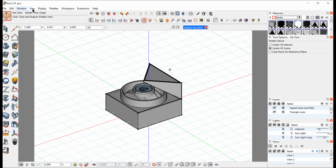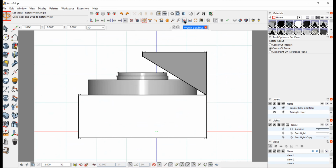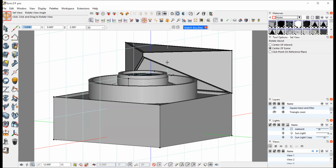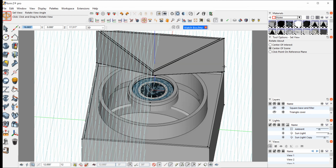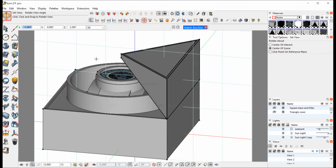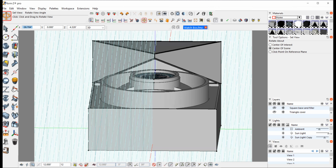And another feature of this part is that I want it to come over the top of the watch and not lay its weight. So any pressure on the top of this box would not be pressing on the watch. I want it to be pressing on the tube. And the height of that tube is significant because that's what's keeping those upright in that position. And also, these are going to be hinging off of that bottom box. So when all four of those hinge at the same time and they meet in the middle, that is also supporting all that weight. So I had this triangulation on all four sections, they're all leaning against themselves and they're pressing on that inner tube. So we have a lot of support and structure on this.